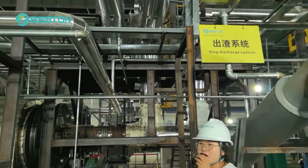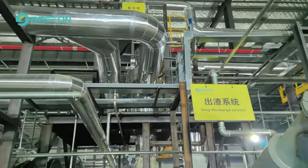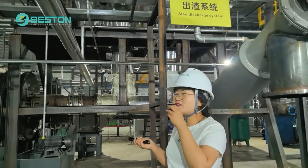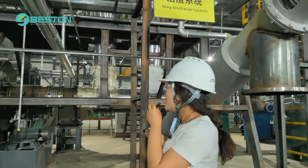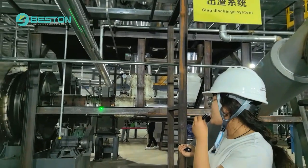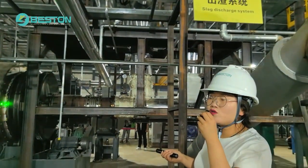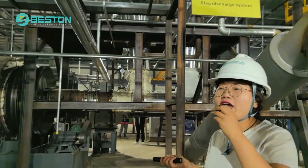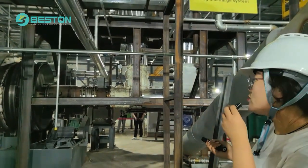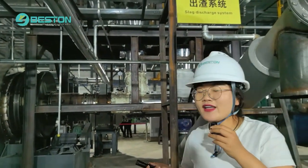This is one of the fastest patents of that system, because you can see the reactor is always rotating. With the previous technology from several years ago, the sealing could not adjust its direction according to the reactor's movement. But the soft sealing system can adjust its own direction following the reactor's rotation, which avoids air leakage, keeps the whole system operating safely, and also increases the sealing system's service life. Okay, next part.